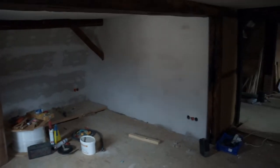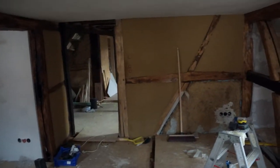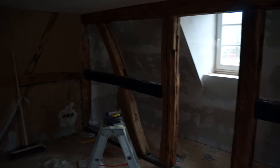In this bedroom, the gable walls have had a first skim done — more like filling really. This wall got another plastering job because it was quite cracked, so I put some webbing in. I also tackled some of the clay plastering, with just one small panel left because I had to put in the socket boxes. There's quite a bit of work to do here with skimming, but it doesn't take long — I just hate doing it at this stage.